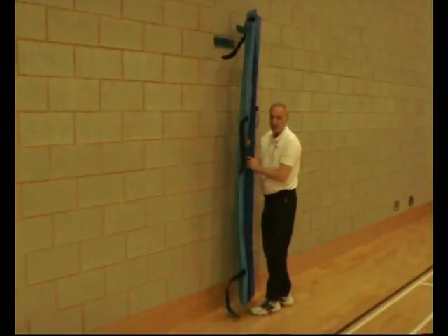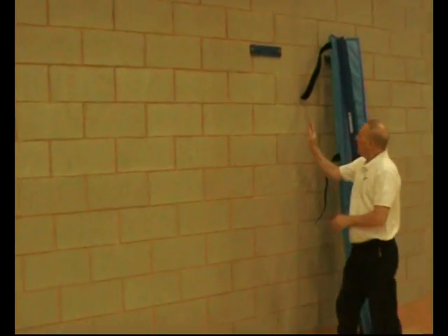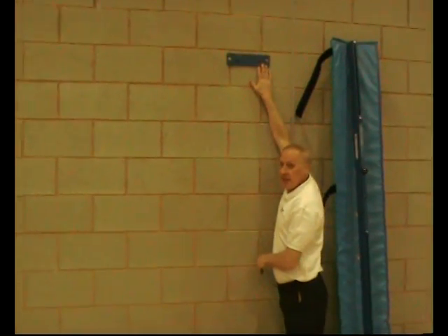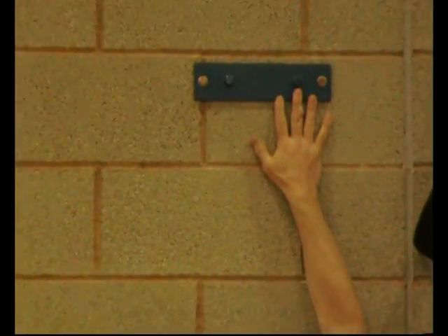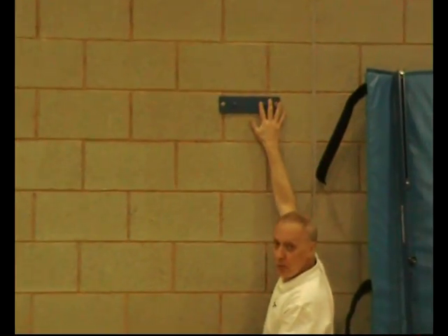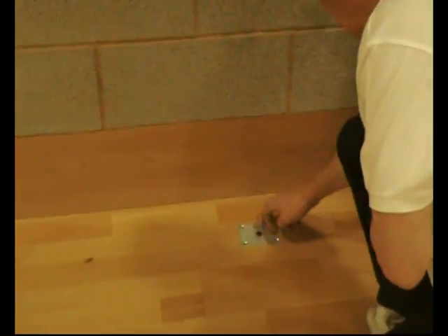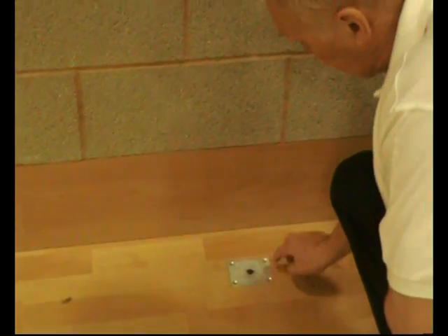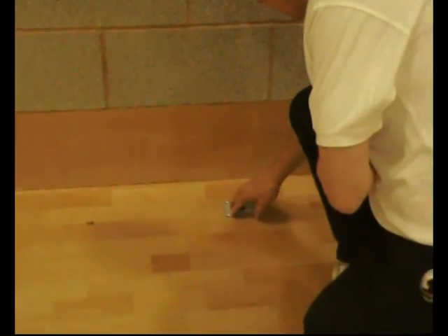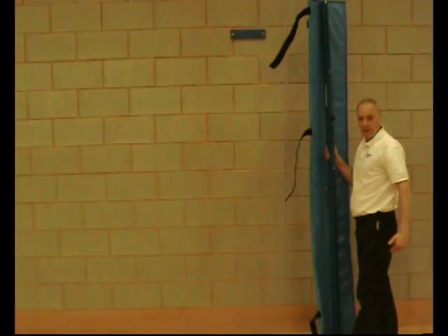The posts are very light and easy to move and can be taken away if you don't want to keep them in the sports hall. The bracket that they hang on is about 2 metres 50, so it's well out of reach for all the people playing other activities in the sports hall. Two bolts go into the wall, and at the bottom we have a base plate which is cut into the floor. It's not very deep, so the pin at the bottom of the post will just locate into there. This floor has underfloor heating and this has not interfered with that at all, so it will fit into all floors. The posts just come out of the stores, hang on the wall, slot in, and it's ready to go.